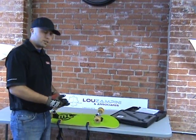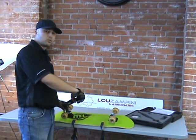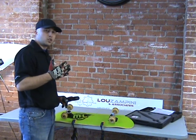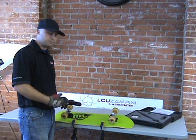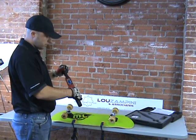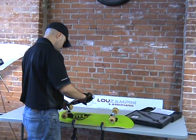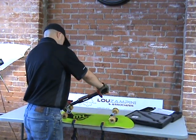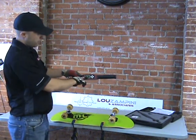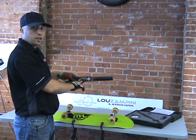I'm going to double check and make sure we have the right amount of torque on this bolt — it's only going to take three degrees of rotation in the positive direction, so if anything we're only tightening the joint a little bit more and not introducing any slack. We switch strategies by going into the menu, selecting the second strategy, and hitting okay. It only took three degrees of movement and it verified 47 inch pounds on that fastener — we're within the spec of the application, everything's good.